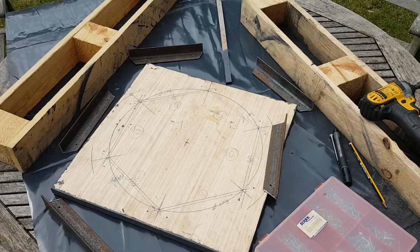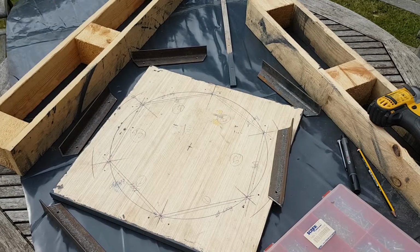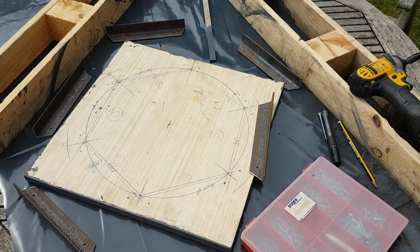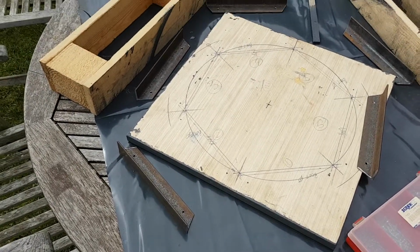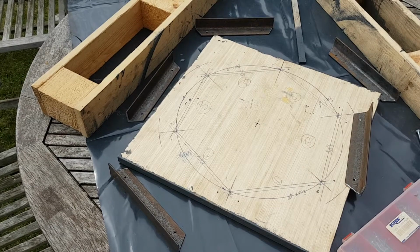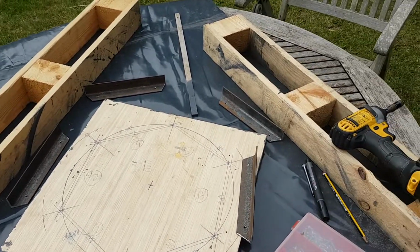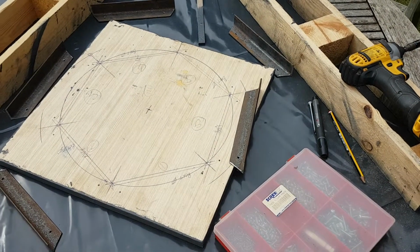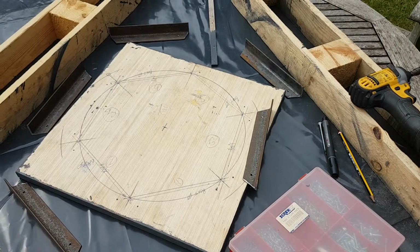Well, on a quite blowy end of April day, I thought I would make a start on the sand muller, after trying to mix sand with a paddle mixer. So set sand, clay pit sand, bentonite clay and coal dust for iron casting. It's pretty much a non-starter. I realise now why everyone has a dedicated sand mixer.